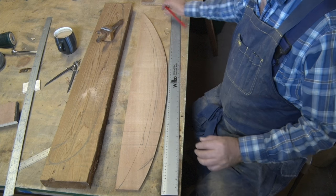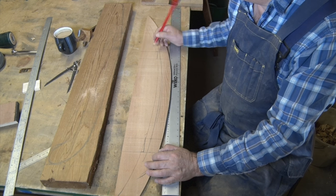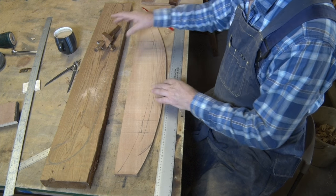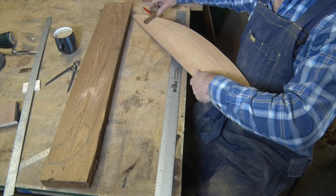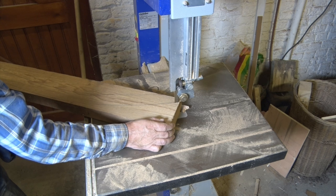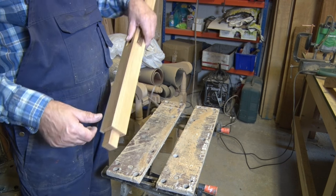To make life easy for myself doing the runner, I've created a pattern. I've marked on here where the legs are going to go. I must admit I cheated — I got this curve by putting a piece of wood up against an existing rocking chair I already have, and then I've used my gauge, two inches, just to follow around there so I can guarantee that's what I want. Then I'll put in these little notches.